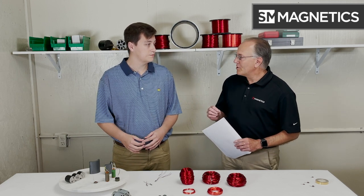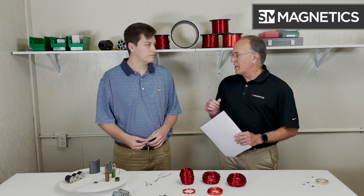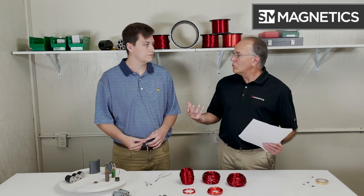Let's talk about air gap — is there a standard air gap that you would recommend? When it comes to air gap in a rotor and stator, that's really the air gap you're talking about in a motor — the space in between your rotor and your stator core. You really just want it to be able to spin. When it comes to optimization, it depends on your design; possibly a 10 millimeter air gap or a 2 millimeter air gap. You just want the most minimal air gap for the space you have that still allows your rotor to turn.